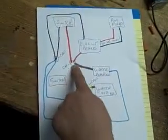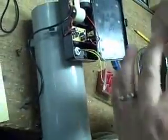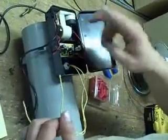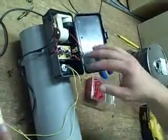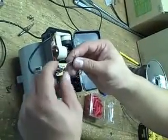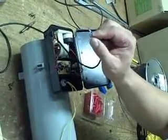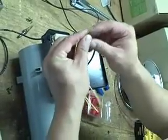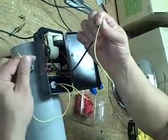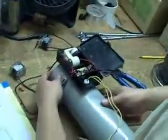Now, the switch has got two yellow-looking lines coming out. That's for these yellow wires, obviously. Now, it doesn't matter which wire you use as far as switching these up. It's not going to matter because this is just opening and closing a circuit. And what happens is there's going to be a water pump, and one of these is positive and one of these is negative. Now the negative side we're just going to wire up directly to the negative, but that positive side we're going to put this switch in there. Basically the way it works is the switch goes to one side and then this one goes to the positive, on the reds, let's say on the other side, and then when this float goes up and down, it actually turns that switch on and off, so it turns power to the pump on and off.